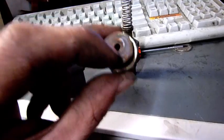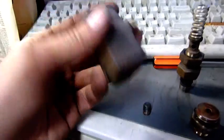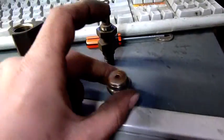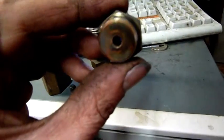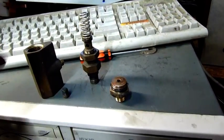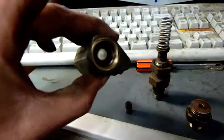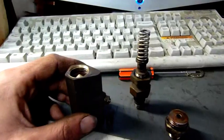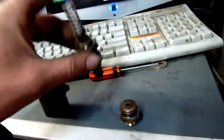The only thing I can determine is there's a bit of wear on this seat here. There's no ball like some people were suggesting — it's actually a little Teflon nipple of sorts. That stainless steel retainer and nipple slide out and close this off when there's back pressure. It's probably supposed to be spring loaded, but it's very stiff — I can't get it out without forcing it. And there's pitting and wear on that seat, probably from fine particles coming through the water, acting like a sandblaster. That nipple also has a bit of pitting and scoring on it, but I'm hoping if I can get it out intact, I might be able to give it a quick skim on the lathe — just take a fraction off it and it'll seal again.